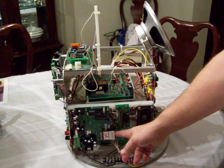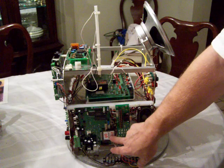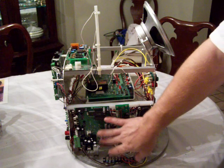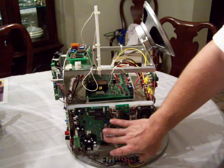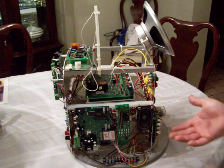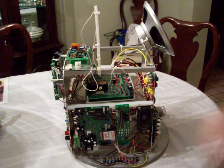It's a compact flash card reader that allows me to download sounds. In this particular case this is a 96 meg compact flash. I configure the simple files that it needs to see onto the compact flash, and by doing so, when the host system is powered up, in the background it will run the mechanical clock sound that you hear through these side speakers — that is just merely in the background.